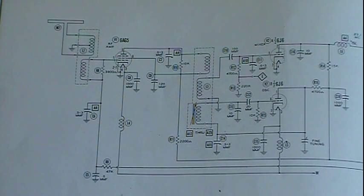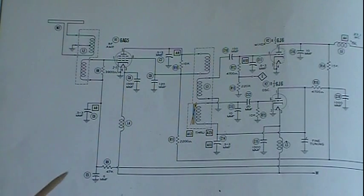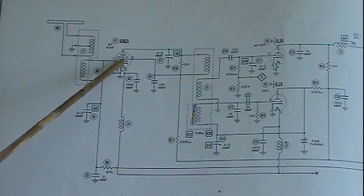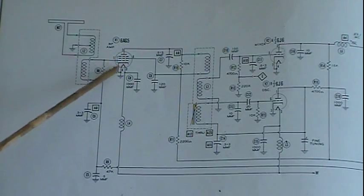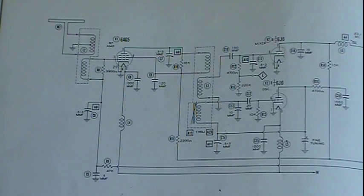Now I was going to talk and am going to talk about some of the other stuff here. First of all, nothing appears to be a tank circuit. Now I went ahead and drew out just one section of the IF, and we're going to talk about where the tank circuit comes from in more depth. But the internal capacitance of the tubes, the cathode to the first grid, second grid, third grid, the cathode to the heater, the plate to any one of these grids, the grids to themselves and to the heater, all this has a certain capacitance.